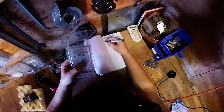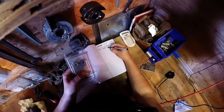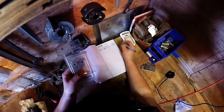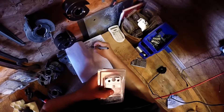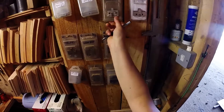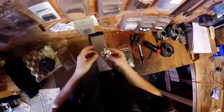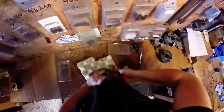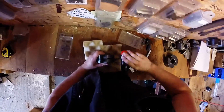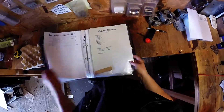I have removed the used blades and I am recording their name and quantity — they are ready for sharpening. We send our blades to be sharpened by a professional tooling company. I am now selecting the required blades and giving them a touch-up with a diamond stone as they have been previously used for a small similar job. They are placed in the cutter head and we will be installing them in a minute. I initially thought I had recorded the profile I used these blades for, but it seems I haven't, so we will have to experiment a little to get the desired profile.